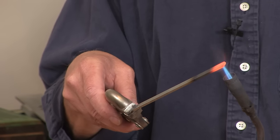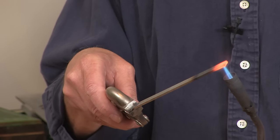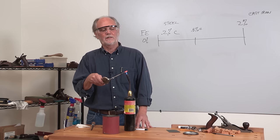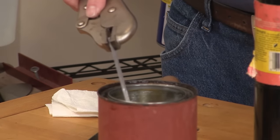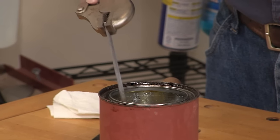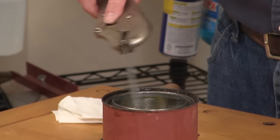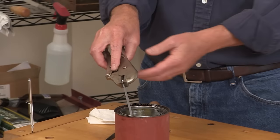There's a dull orange, and then it makes a leap to a much brighter color right there. Before I quench it, I'm going to touch it to the magnet which is sticking right here. No magnetism. And there we go. I promised smoke and there wasn't even any smoke.